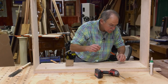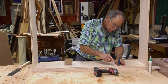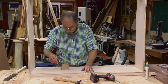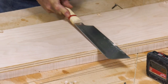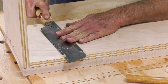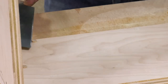I have glue in all of these counterbored holes, and now I'm using these hard maple plugs and tapping them home to the top of the screw — just like that. This is the perfect way to make those counterbored holes disappear. They're sticking above the surface, but they won't be for long, because I'm using a Japanese-style razor saw that cuts on the pull stroke and takes it off ever so nicely. Just take your time, trim them flush, light cut, and then a little bit of sanding makes those holes just disappear. Then I'll put the back of this whole assembly on.